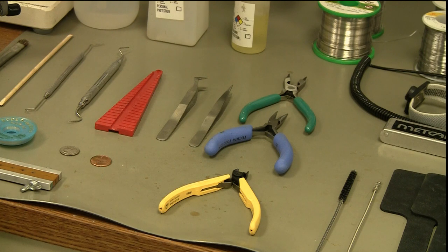The diagonal cutters come in a variety of shapes and sizes. I just need small ones to cut wire below 20 gauge, and they also work well when clipping leads off components for through-hole. To the left of those you'll see two different styles of tweezers — one is 90 degree and the other is straight. It's your preference, so use what you want. They also make a round nose style, so there's a good variety out there.